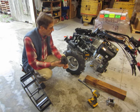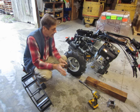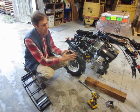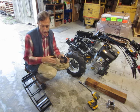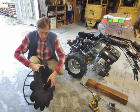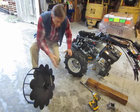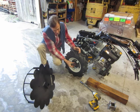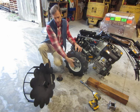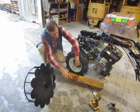If you're buying Superbite Outriggers for an existing tractor you already have, you'll need to be aware that the end of this mounting platform is going to tighten down into a hollow pocket until it bottoms out. This surface and this surface need to line up — that's where it comes down flush. So this receiver needs to end up right about at the edge of your tire. If you sight sideways across the side of your tire, just lay a straight edge across it — that's about where this thing needs to be.